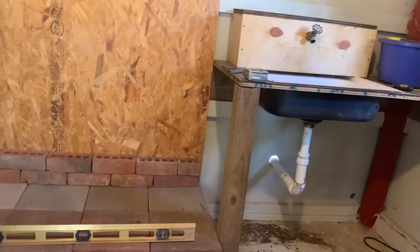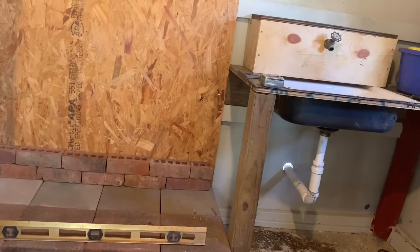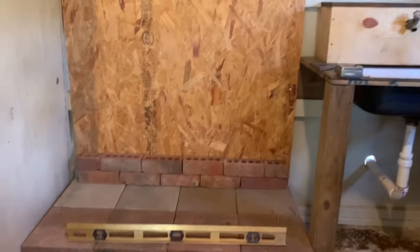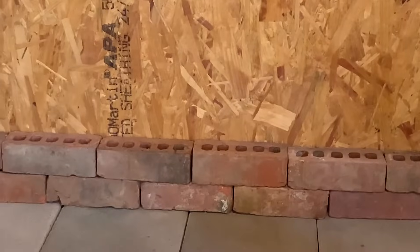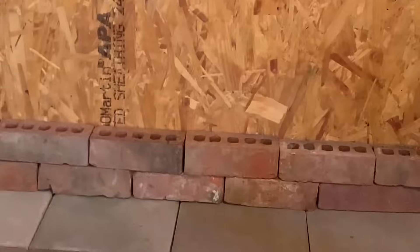I kind of hooked the water up yesterday. She suggests the first two layers, I just glue them. I'll try to put the mortar in them — that'll be their base. I'll have some Gorilla Glue I bought for that purpose. So that's going to be the first thing I do: pull those bricks away and use Gorilla Glue and glue them in place on the back side next to the wall and also underneath so they don't move. And that will be the base — they will never move. And then I'll start the mortar from there up.